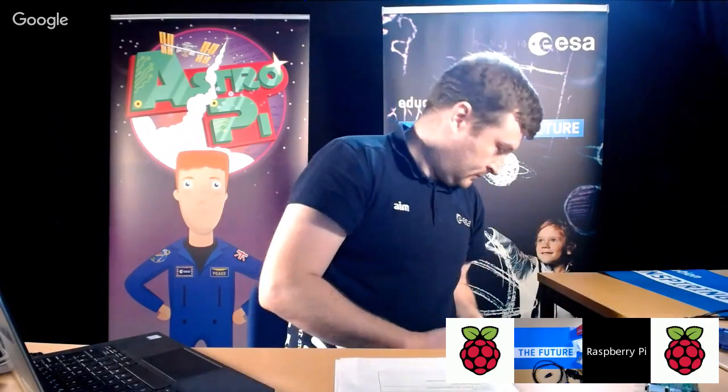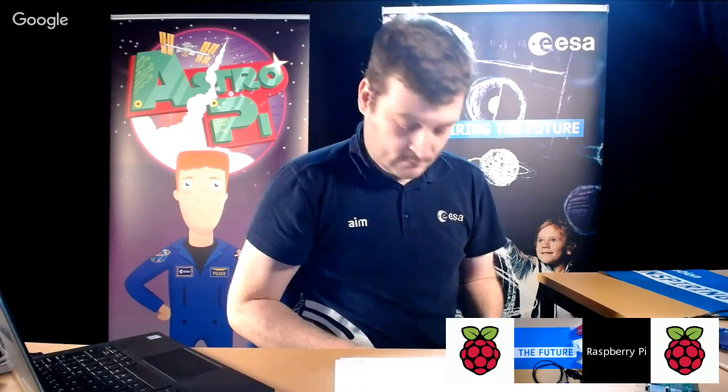I do have one question from Anna Moxes saying about reinstalling the operating system that came preloaded on the card. Which version should they use? Well, if you want to reinstall it, the way NOOBS works is that you can reboot and hold down Shift, and that then takes you back into a little menu which lets you completely wipe it back to a clean OS, which is kind of useful if the kids do anything really stupid and just mess it up so it doesn't boot anymore. You can do that and just completely clean it back to a clean OS.